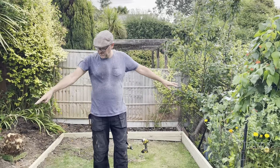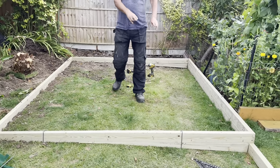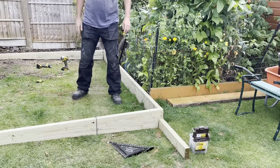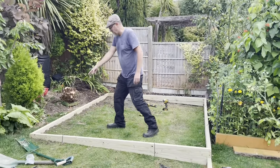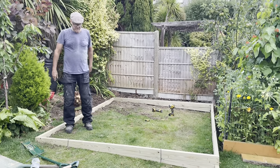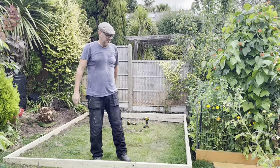We have the shuttering in. We've got it as level as we can, so you can see it's rising because the ground is coming this way. So we built this side up, so it's going to be nearly 8 inches deep this side, running down to about 4 inches this side. That's the only way we can do that, otherwise the shed would be on a silly angle.